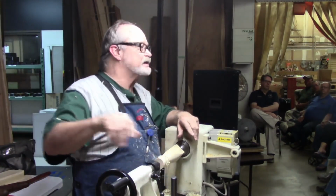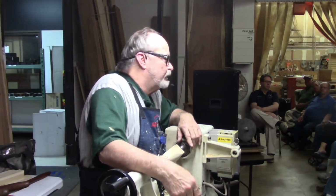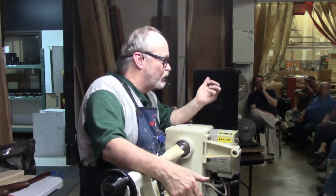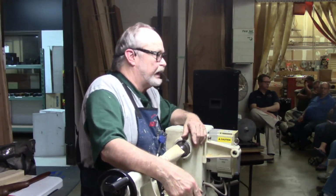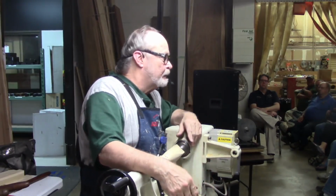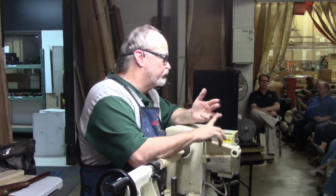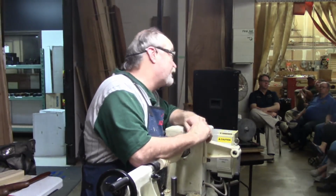Then I have to get into these exotic steels like powdered metal M4, A11, D15, 2030, 2060. They're high-wear steel, so guess what? The burr stays on a long time. So the real answer is note when it's starting to dull and don't screw around. Pull up a new burr. But I can, with a burnisher, produce large burrs, medium burrs, and finished burrs. How big did that feel? And that's a big one.